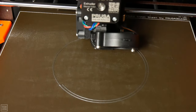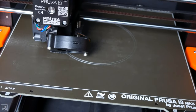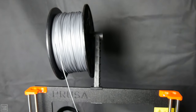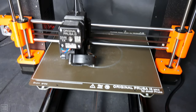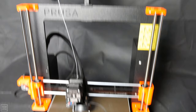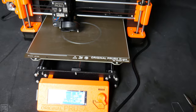This 3D printer is almost identical to the popular Prusa i3 MK3. The MK3 is an iconic 3D printer with a long history of awards and a huge user base. The main difference between the MK3S and the MK3 is the redesigned filament extruder. The extruder now boasts a hybrid system with both an optical filament sensor and a mechanical lever. It is also easier to change the nozzle and PTFE tube. The build volume remains similar to the previous version and should be more than enough for most prints. This MK3S version also boasts minor yet smart enhancements in both its firmware and hardware.